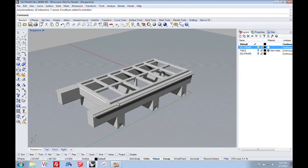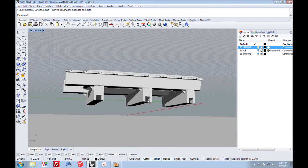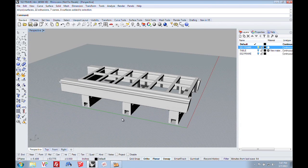What you see on screen is one welded assembly — it's tubular steel, all tied together. That's what makes the machine work. In machine tool design, if you don't have that frame, it doesn't matter what you hang on the rest of it. Within this price range, it's real common to see machines that have bolt-together frames, lightweight aluminum, really flimsy construction. They try to stick a brand name spindle on it and call it a great CNC router, but if you don't do the fundamentals, it doesn't work.